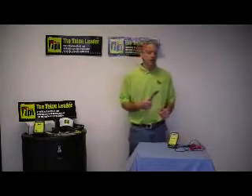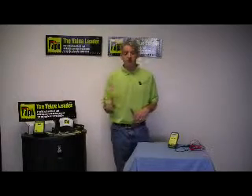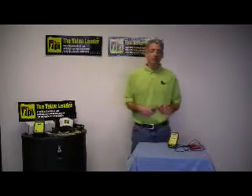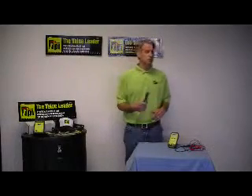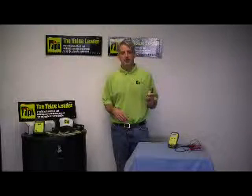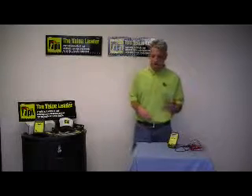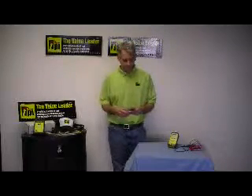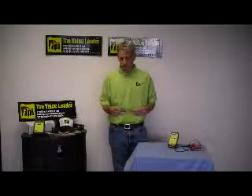One of the things I get asked a lot is how people can check for combustible gases for safety reasons — for their crew, as a personal safety monitor, as they're walking around on their job inexpensively. This particular unit, our model 725, is in fact that item. It's a small personal combustible gas leak monitor and it has a sensitivity of down to 1,000 parts per million methane.